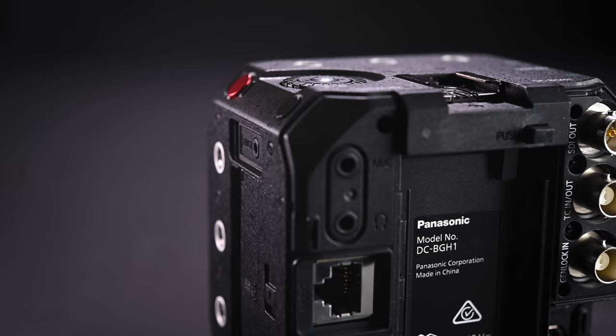At this corner we have three BNC terminals. The top one is the 3G-SDI connector, which can output up to Full HD at 60fps, 4:2:2 at 10-bit color depth. The SDI connector is a lot stronger than HDMI and supports much longer cable runs. Another very cool thing is that the BGH1 allows you to output to both SDI and HDMI simultaneously, even while recording internally to the SD card, giving you a lot more flexibility for outputting and monitoring your footage.